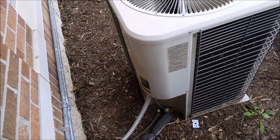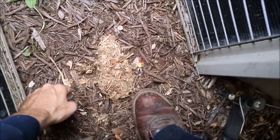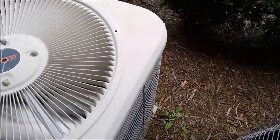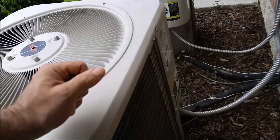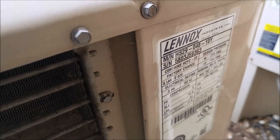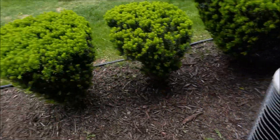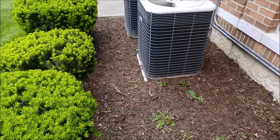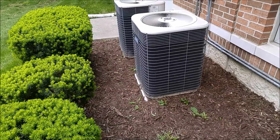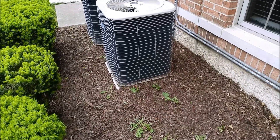Got it up and running. Pressures are good, temp drop's good. I had to evict my mouse — there's nothing you can do. So this is on an HS29 from 2003, R22 unit. That's it for this one guys, I will see you on the next one. Just a quick contactor fix. Thanks.